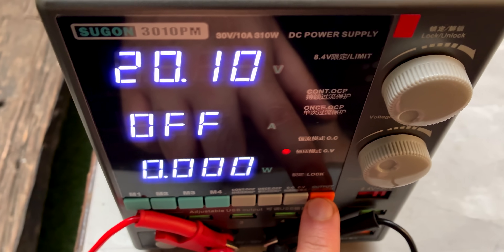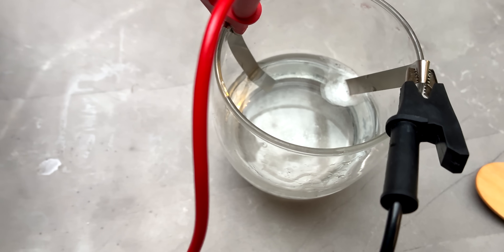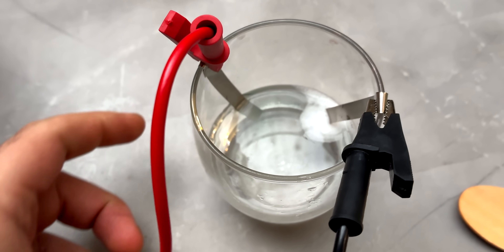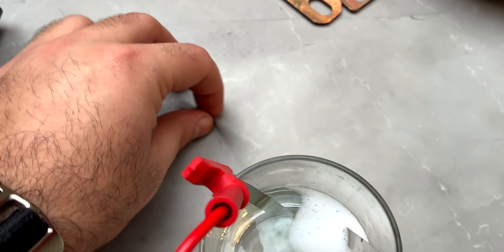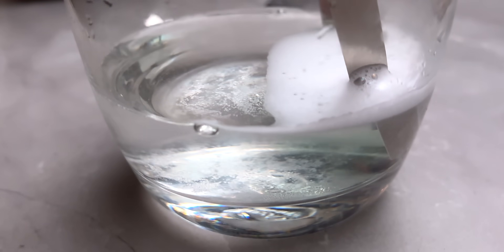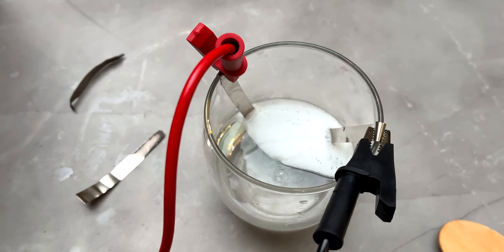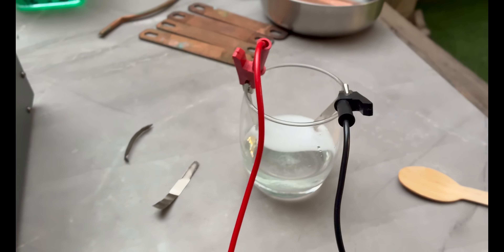You can see it's already drawing half an amp, which is fantastic. The bubbling means electrons are flowing from the positive side to the negative side, and the anode is being sacrificed — you'll start to see the strip decay. I have examples of previously used strips that show how they reduce over time. It's frothing quite a lot, and you can see bubbles rising, which signify it's working well. We want to let this run until it turns that green color — you can already see it starting.